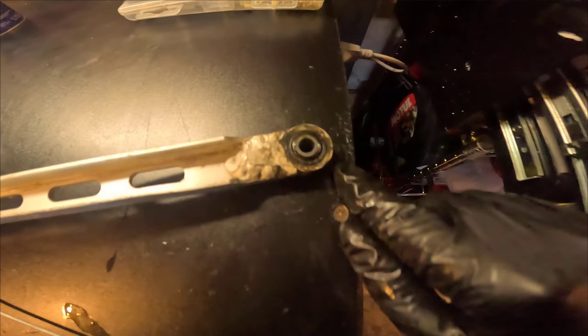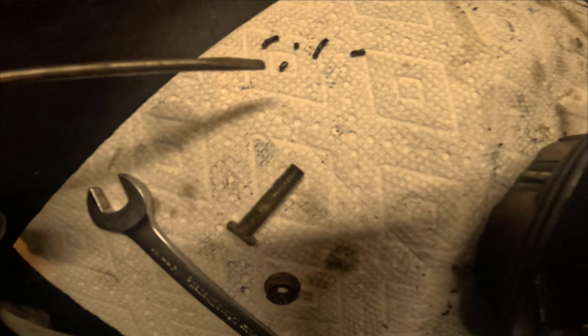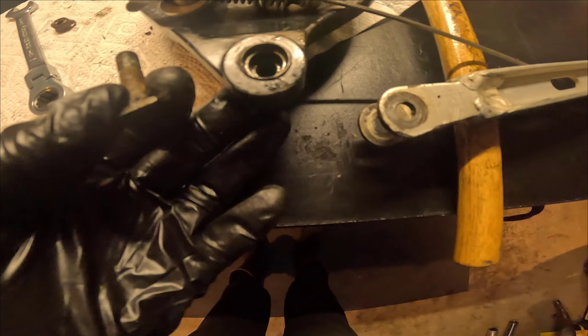Okay, so I put grease down there and then looking at this part of it, I pulled it out. That's the o-ring that was in there. I had to actually hammer this out — it was seized in there. So another o-ring and some grease and she'll be good.